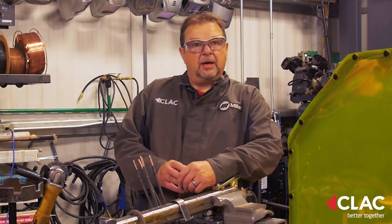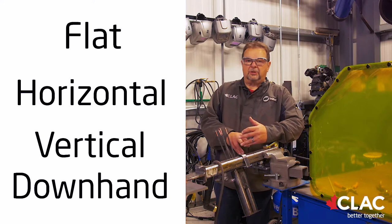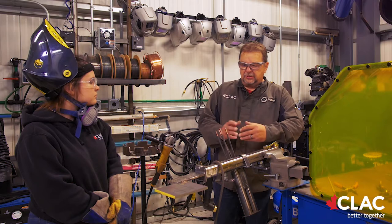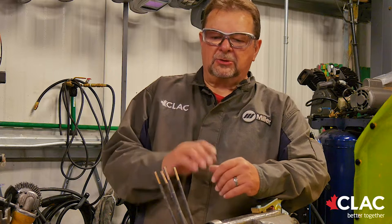Normally when we're testing for CCO, we're testing in three positions: flat, horizontal, and vertical downhand. In the flat and the horizontal, they take a piece of six-inch mild steel plate, mark a line an inch and a half wide in the center of the plate, and weld two passes on — two layers on the flat and the horizontal.